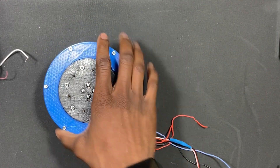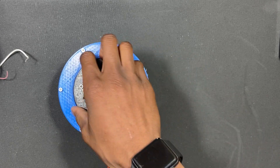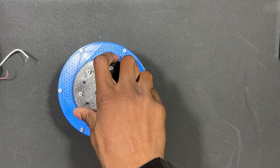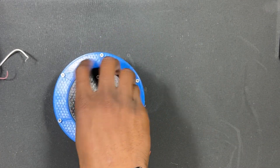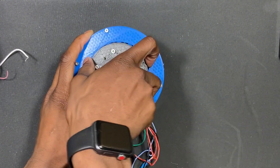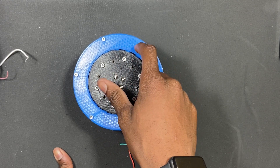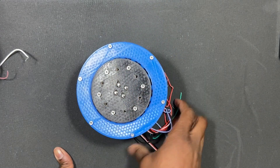Version two was a little bit better, but still not the efficiency I wanted. It uses a stepper motor with a 9 to 1 gear ratio and a belt and pulley system. This one is highly backdrivable — I can just turn it without the servo on. It also has the stepper motor driver inside, so you just plug it into an Arduino or whatever microcontroller you're using.